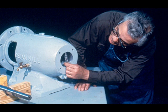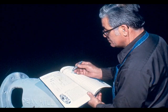Next, inspect the bearing fit in the bearing housing to be sure that it is not worn or damaged. Measure the fit to be sure it meets the manufacturer's specifications. In other words, the manufacturer of the bearing you will be installing specifies that the inside diameter of this housing must be a certain size to accommodate his bearing. You have to make sure that you meet his specifications. If you don't, you're asking for trouble.